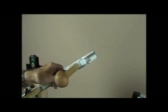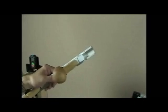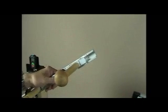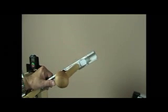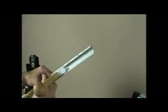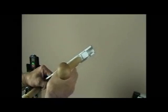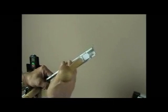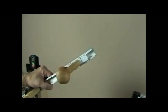That brake you saw was a black plastic part that simply pressed against the inner surface of the aluminum extrusion, so it doesn't leave any marks at all. Unlike wood, the people that use wood unfortunately have to deal with that problem, because when you press something against the wood, depending on how you do it, there are ways to avoid that, but nonetheless, you don't have that smooth, running surface here. As long as you loosen the knob 3/4 of a turn, it'll slide back and forth with no problem. If you only open it slightly, you could get what I call chatter, and that's simply because the brake is causing the assembly to catch every now and again. So you just loosen about 3/4 of a turn, and then tighten it where you'd like.